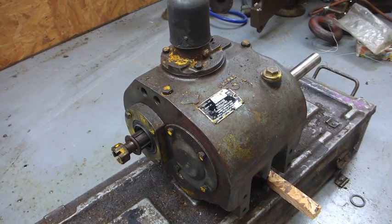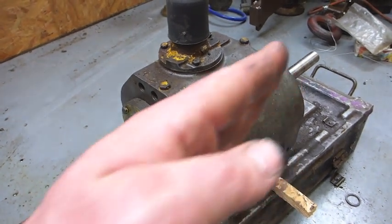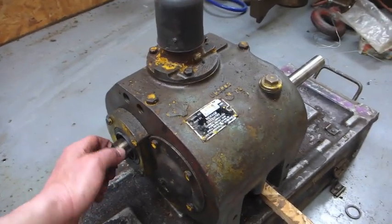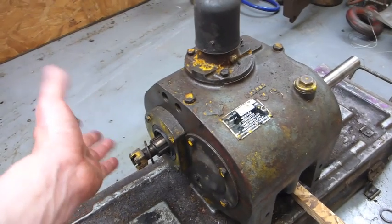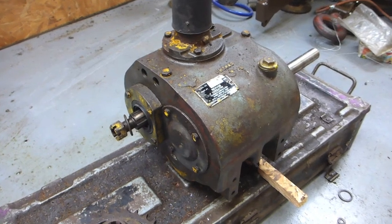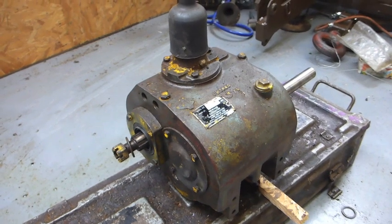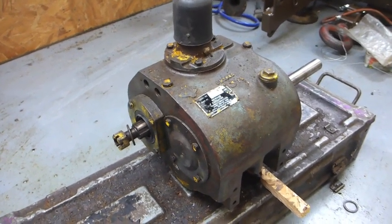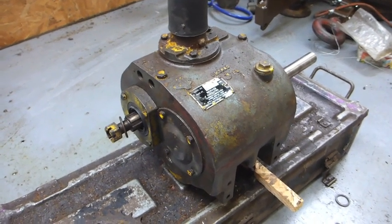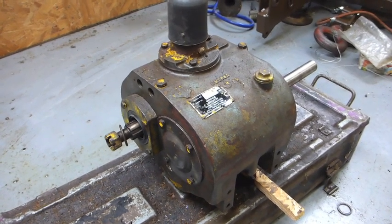Where the needle rollers had sat stationary — the machine had been stood for a while — they'd actually corroded little scoring lines on the main shafts. I didn't even ask what they'd cost, they were just going to be expensive. So I put the shafts up in the lathe. There was no way they'd have run as they were on new needle rollers. I polished the corrosion out, but by the time I'd done that the shafts were five thou down on diameter — and five thou for a needle roller is quite a lot of play, a recipe for it to die pretty quickly.